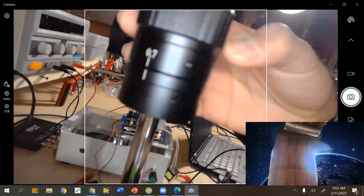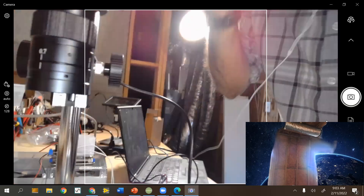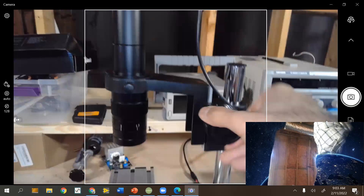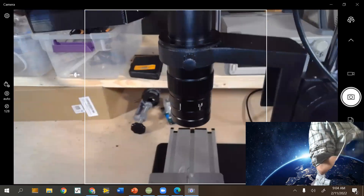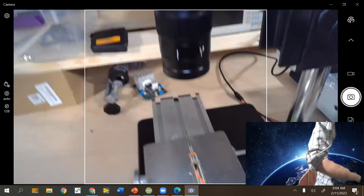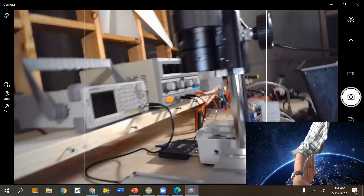There's a zoom function right here - I have it set at about 1x, but you can set it at 0.7 and rotate it all the way up to 4x. I've looked at the resolution and it's about 2 pixels per micron. There is a focusing knob for gross adjustment, and we actually have about four to five inches of working distance between our target transducer and the microscope, which doesn't allow these things to bang together.